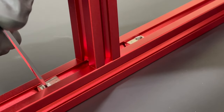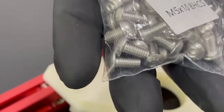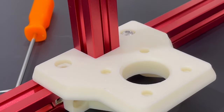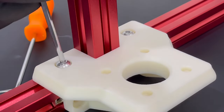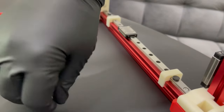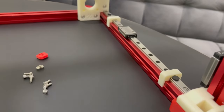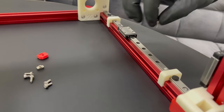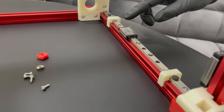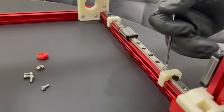Now we're going to install the Z motors along with the motor mounts. This is that part where I told you that if you're going to be doing the inverted electronics bay mod, you need to get different Z motor mounts. They look the same but they don't have as wide a lip. This is very beneficial because in the future when you're wiring and working on your 3D printer, you don't have to flip it over. This is an expensive, heavy machine, so if you can avoid flipping it over at all, that's much better. This section is super straightforward — you're just going to install more linear rails and install the Z motor mounts.